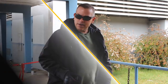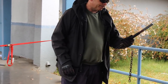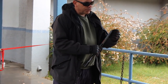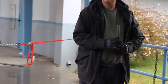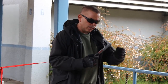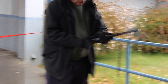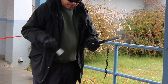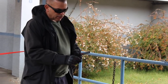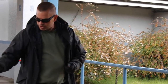So that's that. Now I'm going to do a cut on rebar. You remove your burn rod, flip it around, stick it in there. There's a red igniter tip — it needs to be down and away. This thing is not going to light properly if you have it pointing up or at the wrong angle — you want the heat of the thermite match to pull up into the igniter tip. Remove your thermite match, making sure the orientation is correct. I'm going to strike and light it. When I light the match, what do I do? Drop it and focus on your cut once it's out of your hands.